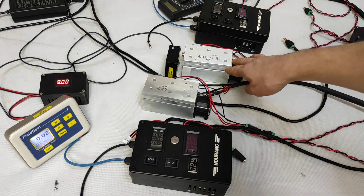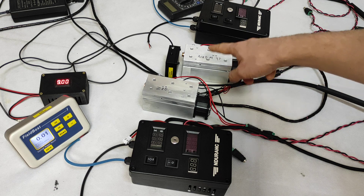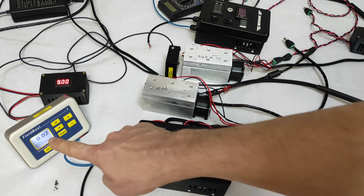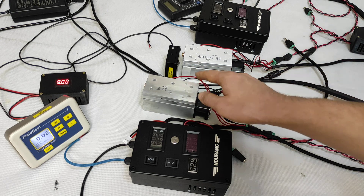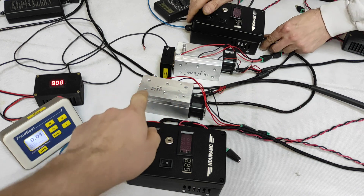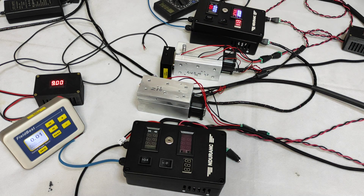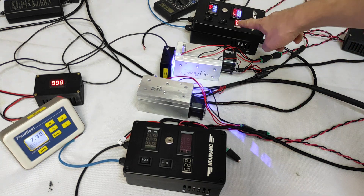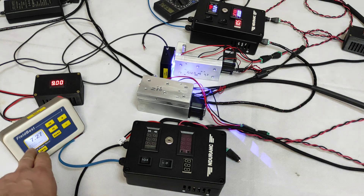Right now we are going to turn on our current 10W Plus Pro that we're using with the NICHIA NUBM44/47 diode. We'll show you the power that we have on our power meter, and then we'll turn on this laser and adjust current and voltage. We are using a G2 short focal lens. It's unfocused and has some losses — like 5% losses. So our temperature is in range at 25 and going down to 24. We have 4.8 volts and 5 amps, and we have here 7.3 to 7.2 watts optical power — CW power.